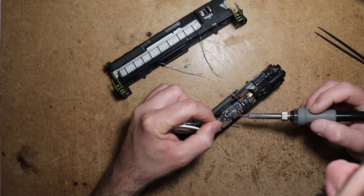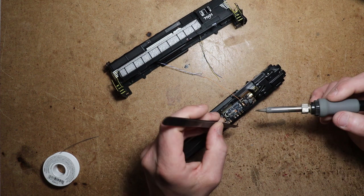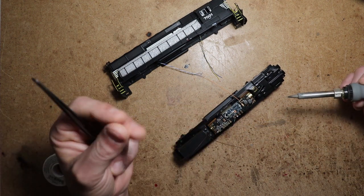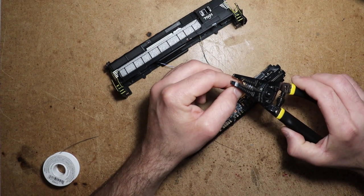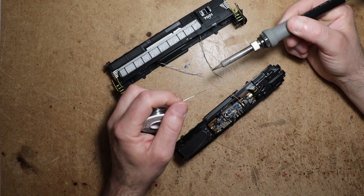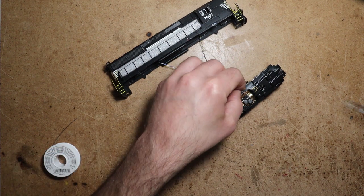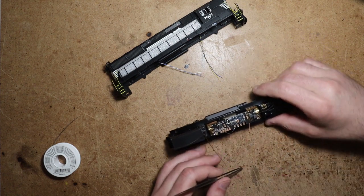And it's important to understand that flux does not clean the part. It simply deoxidizes it. The parts get oxidation from air, oxygen, and that's all that the flux is doing. You still need to clean the parts or have clean parts. Flux can help circumvent or overcome dirty parts, but that's not what it's designed to do, and you'll probably end up with a compromised solder joint.